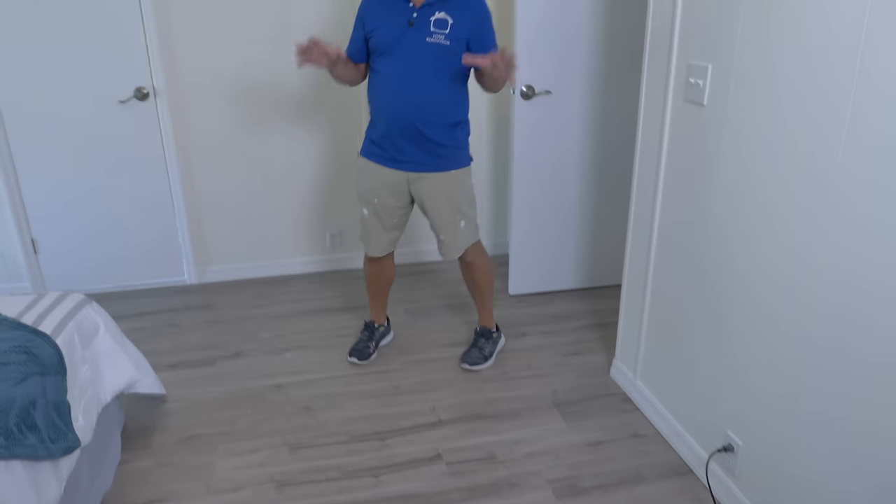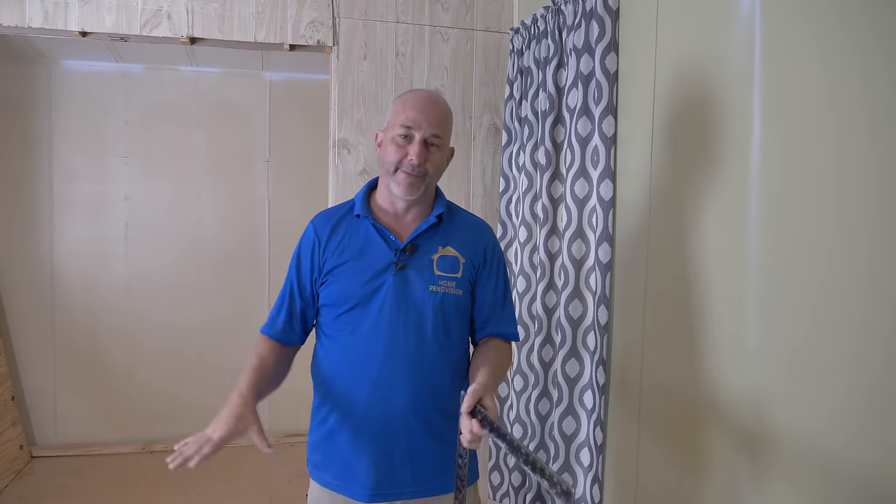Today's video is not about vinyl floor installation — it's about your subfloor. If you have old, nasty subfloor you don't have to remove it; you can actually add a new layer on top, which is what we're going to do in this video. I'm going to show you how to do it and save you a lot of time and money. We're installing 5/8 plywood on this floor.